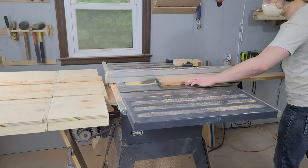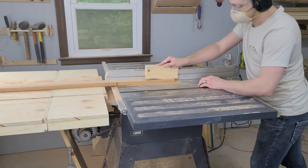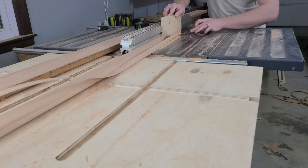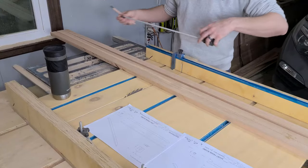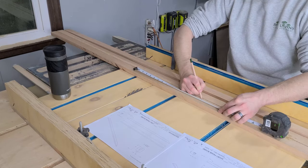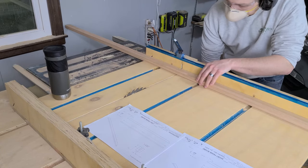The first thing to do is make the frame pieces. We start by ripping a four quarter board into a couple strips that are slightly wider than we need for the frame. Then we move our fence in a bit and rip each strip to its final width. This allows us to clean up both sides on each strip and ensure that we have perfect edges. Then we grab our crosscut sled to cut each strip into the four pieces that we will need for each frame.